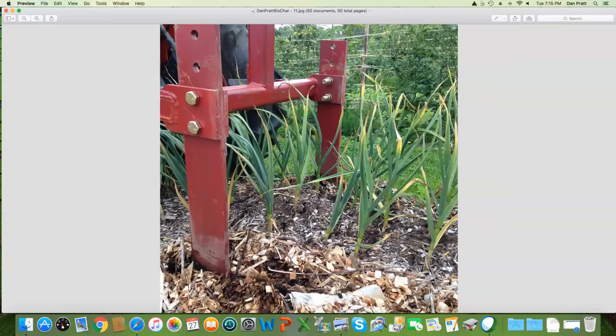The bed undercutter, you have to basically dig a trench and drop it in at the end of the bed. And then the tractor creeps forward with this blade down, in this case, probably 4.5, maybe 6 inches deep. And it was really cool to watch. The garlic would sort of lay back and then pop up straight. It just did the minimal amount of soil disturbance.